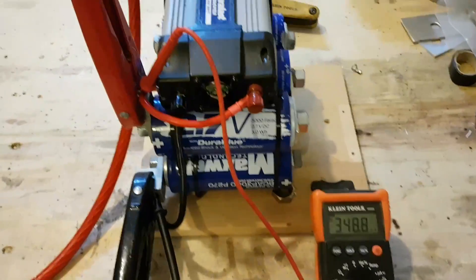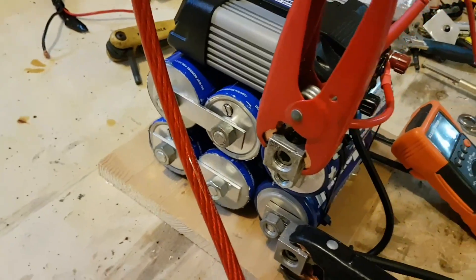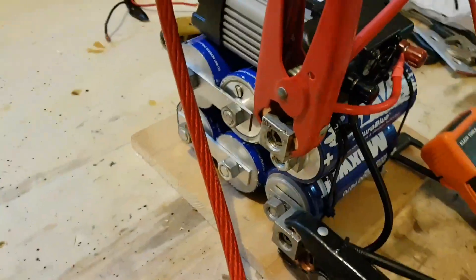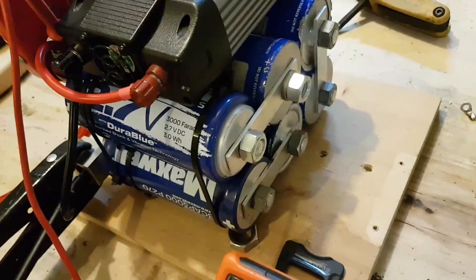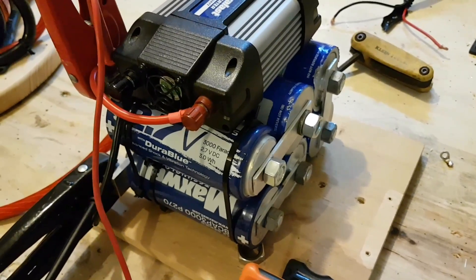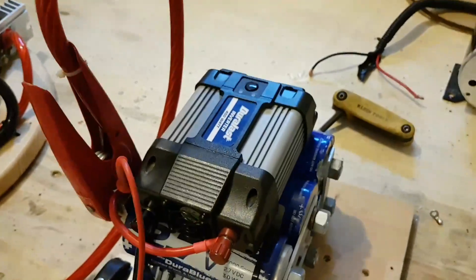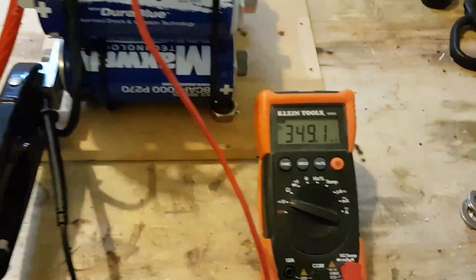Here's my new setup. I upgraded with two more capacitors to bring it up to 14.4 volts, and they're all tied in series because 2.7 volts is useless. Even though it has incredible amperage, I still have to bring up the voltage to be useful for something. I got it on my inverter here which will power it, and I'll show you how fast this will charge up.